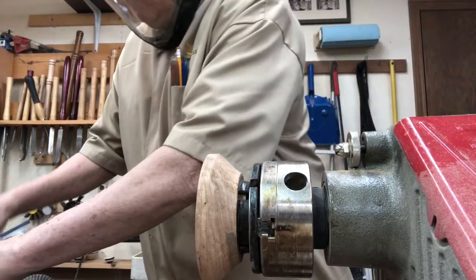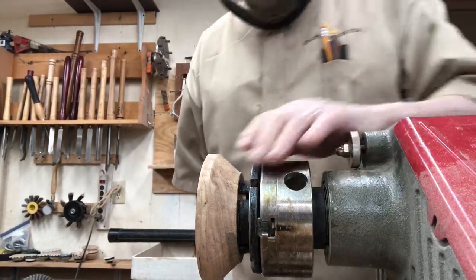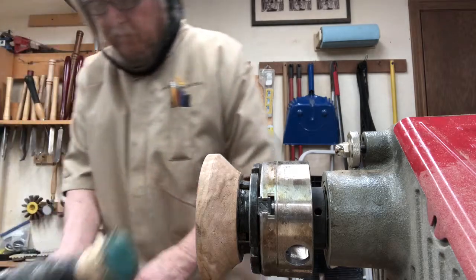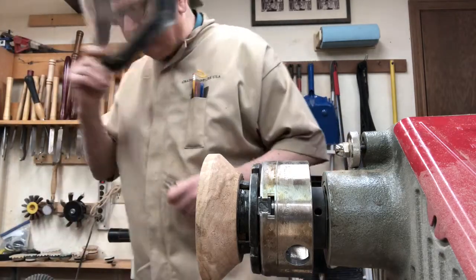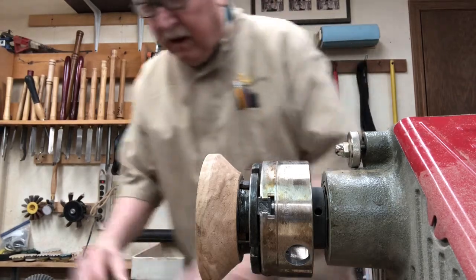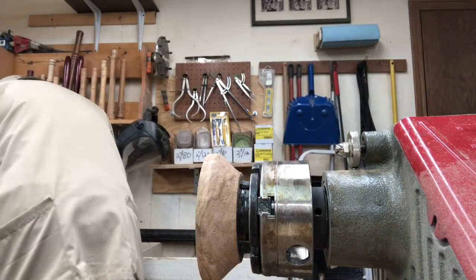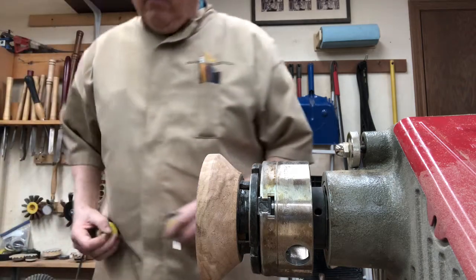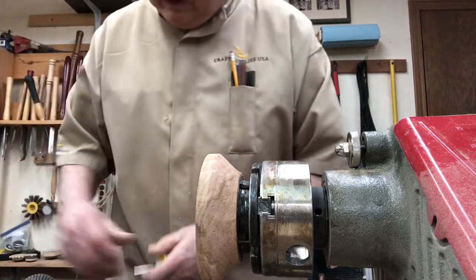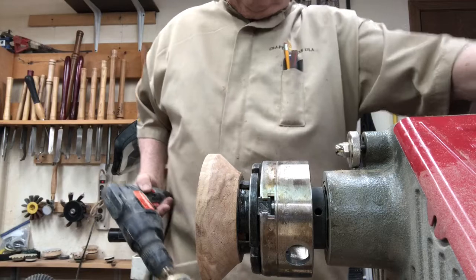The next step is to begin to sand the pieces. And haven't done any of that yet, so I think we'll start here, sand this underside. And for that we'll be using a power sander, and we've got 3 grits. We're going to have an 80 grit and a 120 grit and a 220 grit. So I think we'll just stay at this speed, although it's pretty high.